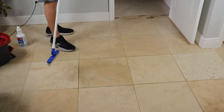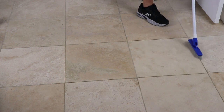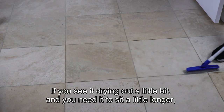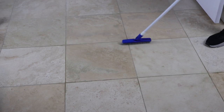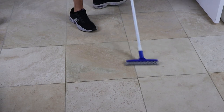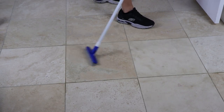Okay, let's scrub this up — it's been a few minutes. I always concentrate on the grout lines first. As long as the product is wet, it's working. If you see it drying out a little bit and you need it to sit longer, apply a little bit more. That's not dirt — that's just a bad grout job. Go over the stone. This isn't real dirty, so if yours is dirtier than this, it might take a little bit more. Just turn your brush on its side and clean it all up.